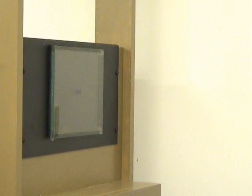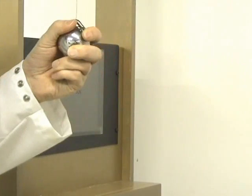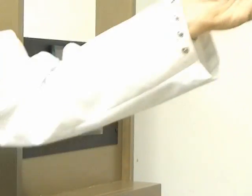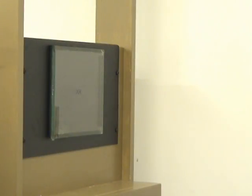The ultimate in safety shield technology is to utilize dual panes of untempered glass with an optical silicone adhesive between them. The mounting of the glass to the test fixture is the same as in the previous tests. However, the bonded glass survived 32 direct hits by the ball with no failure whatsoever. The glass did not break and no particles were ejected, and thus no sharp edges are a concern to users.